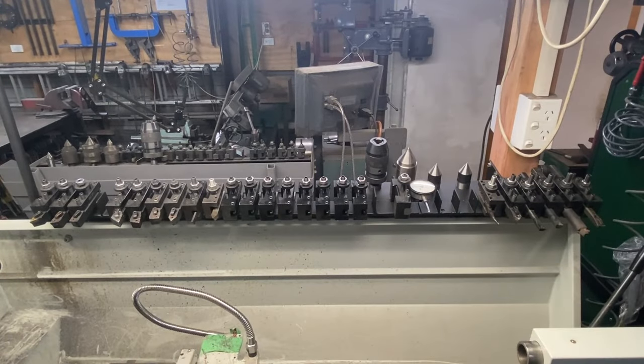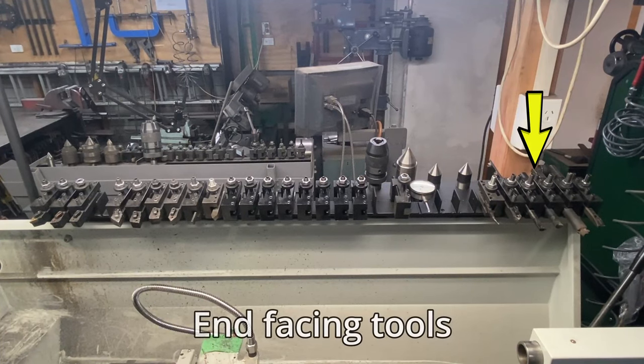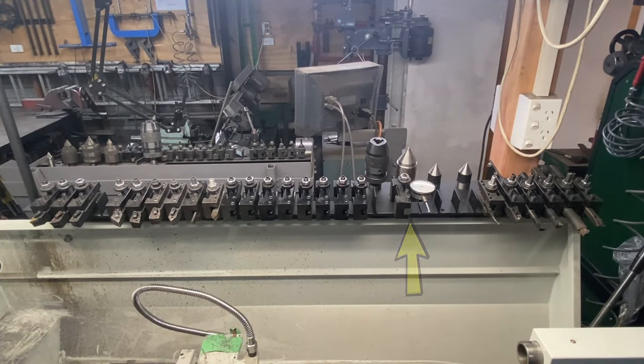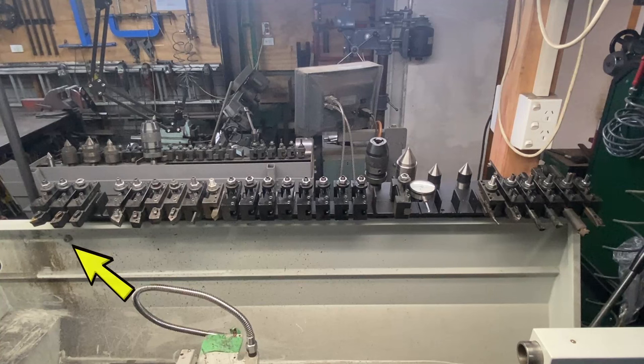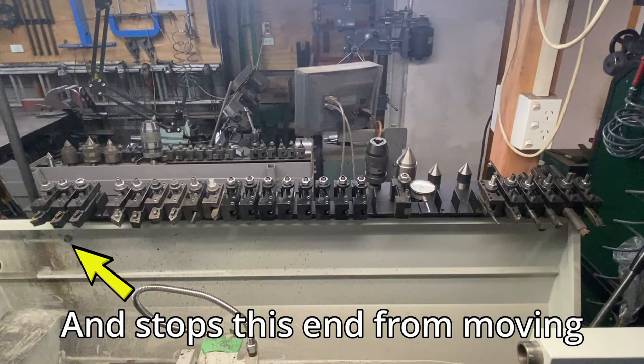There it is, fully stocked up. Starting from the left, those three tools are left-hand tools; the next three are right-hand tools; next to that a parting tool and another standard tool; then eight new tool holders. The tailstock tools are at the back, and on the right-hand side we have boring bars and other facing tools. I've even put my dial gauge in the extra-wide holder. All of the weight is held up by that bar on the left and the bracket on the wooden post — the screw at the bottom doesn't take any weight, it just keeps the tool holder parallel.